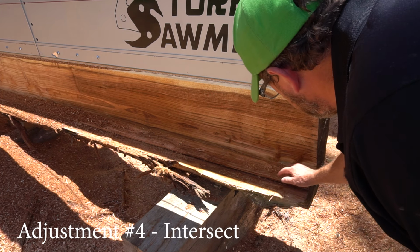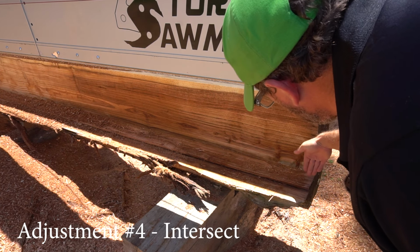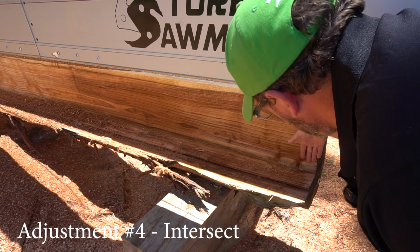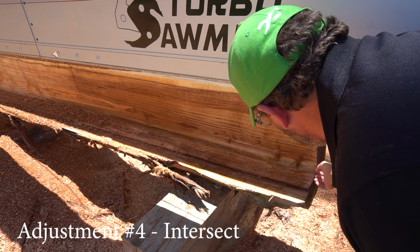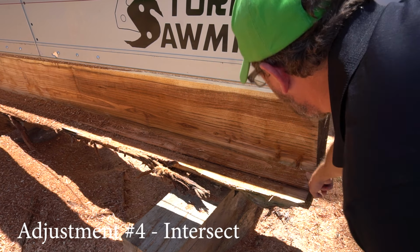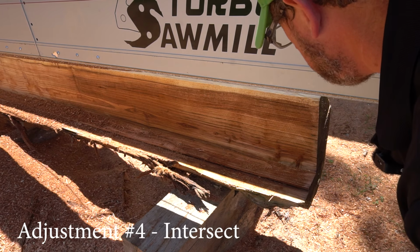And you'll also note when you're doing shallow vertical cuts, a little bit of spring tension in the cut won't pull down as much as a 12 inch, right? So in the 12 inch, it's pulling down a little bit. So I've only got a couple of mil there, but you know what? I'm happy because it's not drawing lines. If it's drawing lines, then the blade's too far down. I need to bring it up a bit. So there's a couple of things to consider there. In shallow cuts, you should have about a 3x3 square from one end to the other. Obviously, that square gets cut away every time you do a board. So that's just an indication of how those two cuts meet.